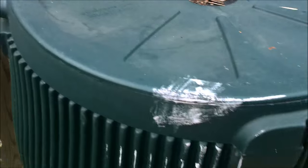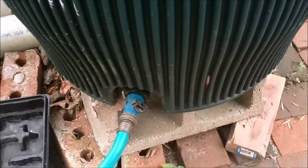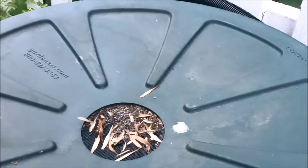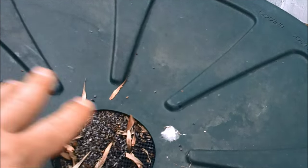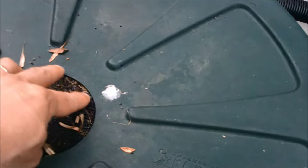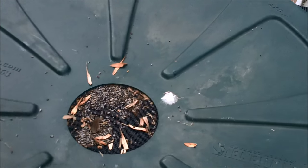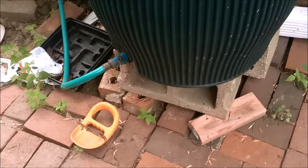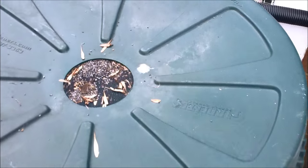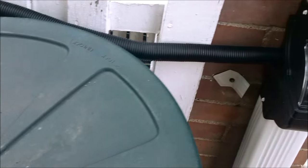We bought one of these — this guy right here has got a little output. It's super cheap but it's all plastic. The idea generally was that the gutter here would run into the rain barrel, and this would keep out the mosquito larvae and things from the ash tree and stuff from the gutter. It works great, except when the rain barrel fills, then this whole region here would just flood with water. Our roof fills up this rain barrel very quickly and then water goes everywhere.